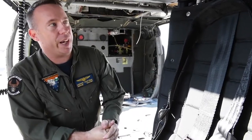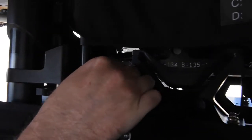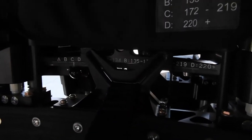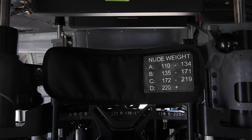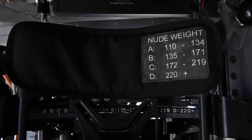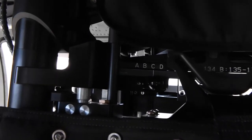The next real important change between our old gunner seat and the new one is making sure you get a good weight adjustment. There are four different adjustments that actually protect you in any crash. You can set that based off of the weight parameters that are right there on the headrest. You want your naked body weight adjustment to reflect so that you're getting the proper amount of crash attenuation if you were to need it in a crash.